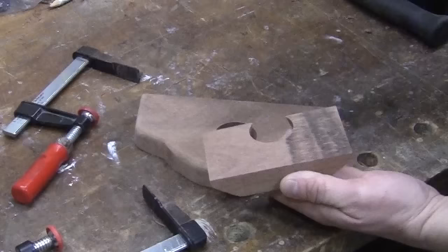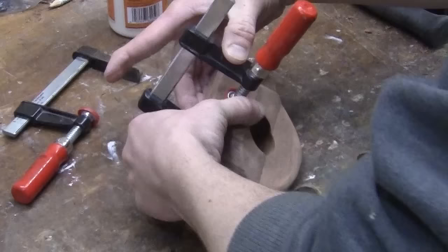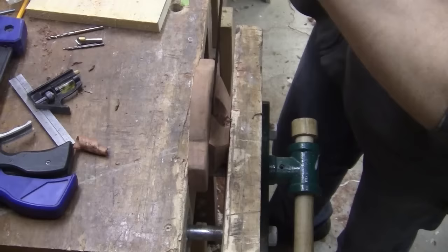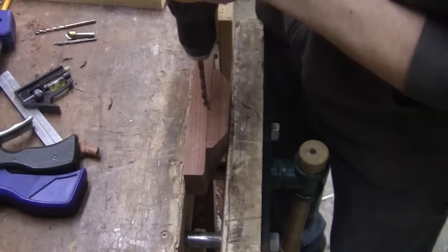After the cutting is done, glue the upper piece to the lower. After the glue is dried, drill an eighth inch pilot hole through the pieces. Here Chad is using a very long bit so the chuck of the drill won't interfere. Now he switches to a bit which is slightly larger than the size of the thumb screw.